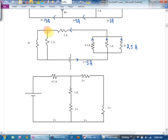Okay. Which way is the current flowing in this 2 amp current, up or down? Down. How many amps must be in this resistor then? 3. Also down. And they join together at the bottom of the ski lift. Bottom of the chairlift. See, the ski hill analogy actually worked really well.